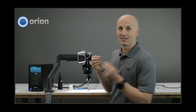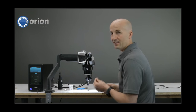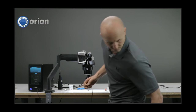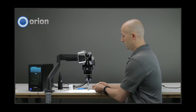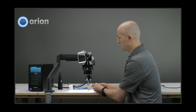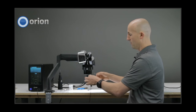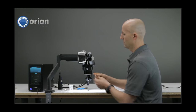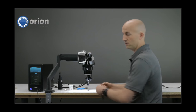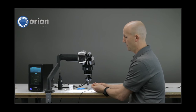You want to hold steady and have your fingers close. Use the table, or wherever you have your welder, to rest your hands. If you're holding the wire and ring with unsupported hands, you're going to be really shaky. So keep fingers close and rest your wrists on a table — that's going to help you be even more steady.